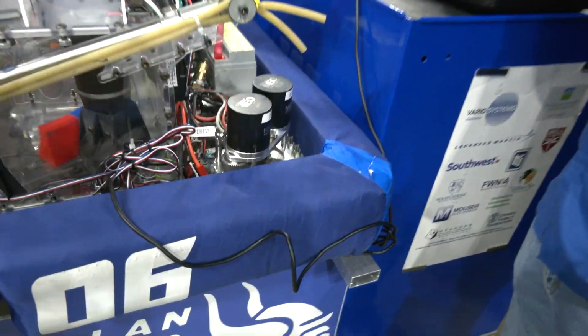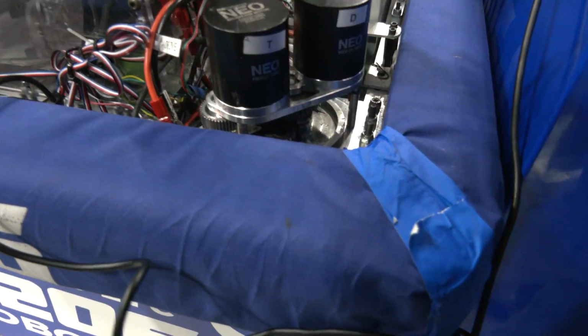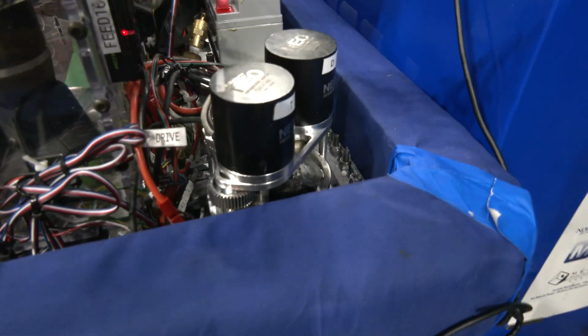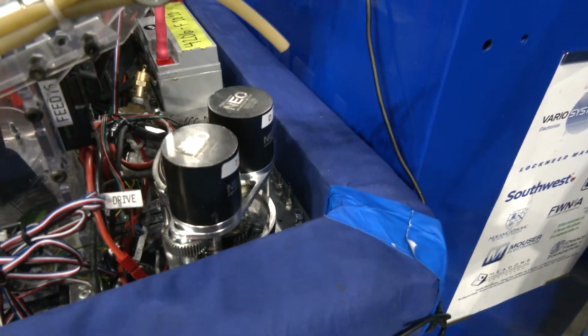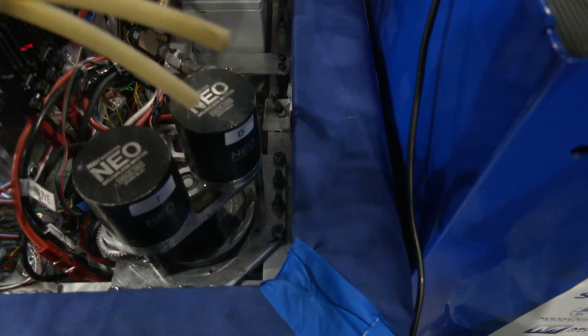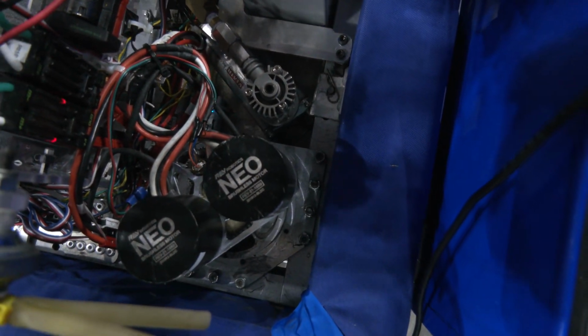Yeah, so on these swerve modules, the ones we're using are the Swerve Drive Specialties MK2 modules. We chose these because of a lot of choice and movement, and also they negate the need for a turret, because due to targeting, you can move and spin at the same time. This gives us a lot of time off manufacturing a turret and many other things, and saves us power. And also, it's great for defense and offense.